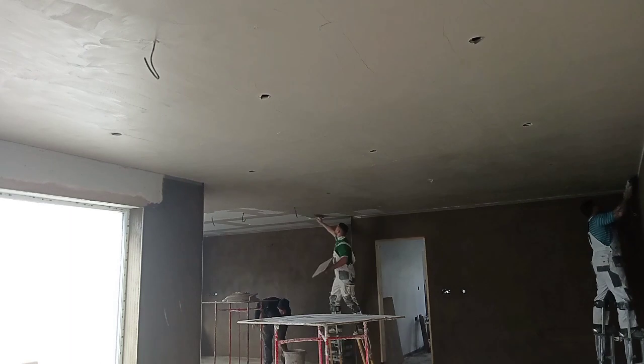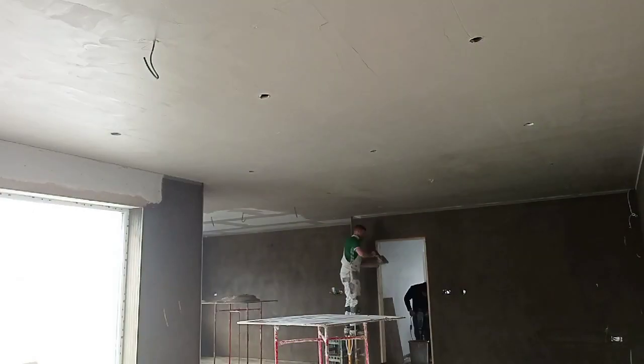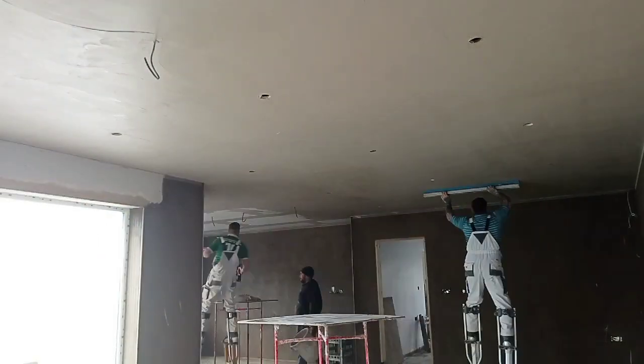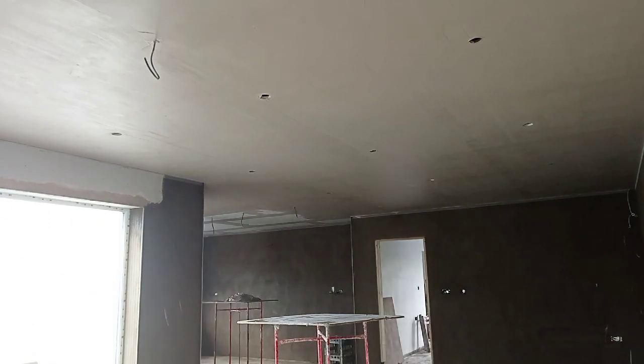We always lay our skim on as neat as possible. We find that throwing a lot of stuff on quick but messy will only cost you time further on down the process. And once we have our first coat on, we quickly close it in using a speed skim before we start to go on to apply our second coat.